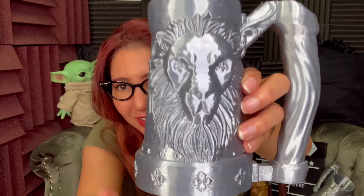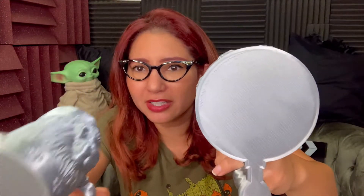With the fast quality there is a pretty big difference — the layers are not laid down as nicely. Also, with the fast quality it didn't even finish to the top; it just stopped and didn't feel like it needed to finish the mug. If you're just making a prototype for yourself the fast quality isn't too bad, but it took less than a day to make whereas the high quality takes like two days in Cura. On my Snapmaker for normal quality — which is pretty much the same as the high quality for Cura — it took three days.